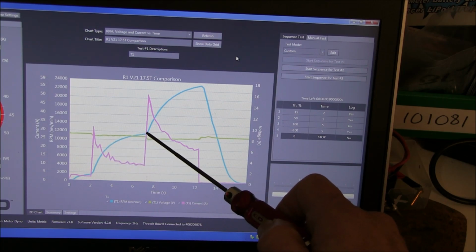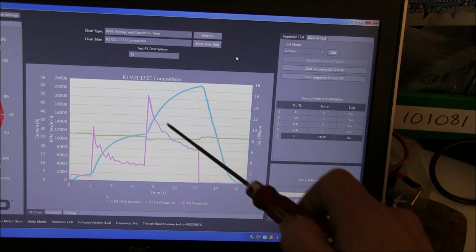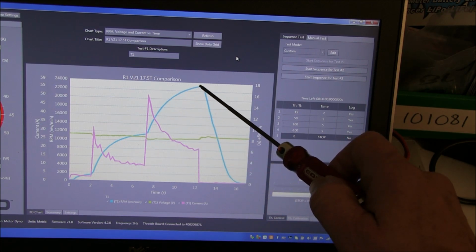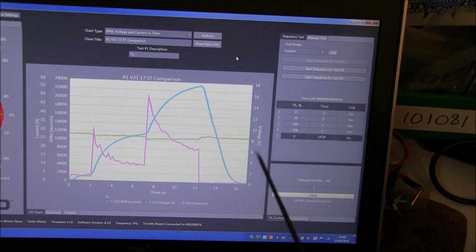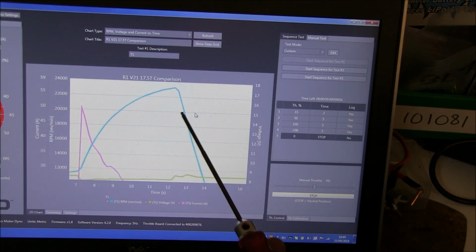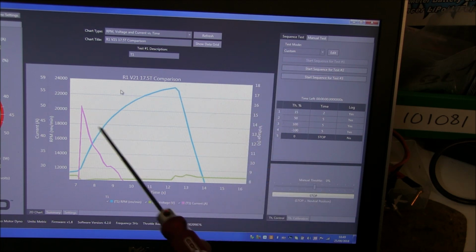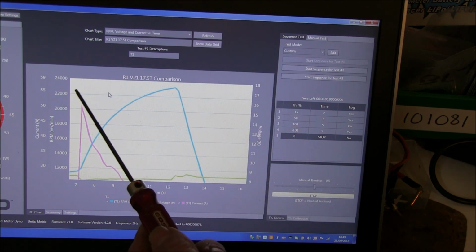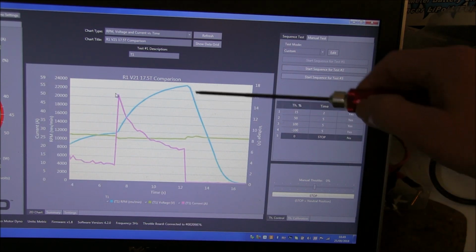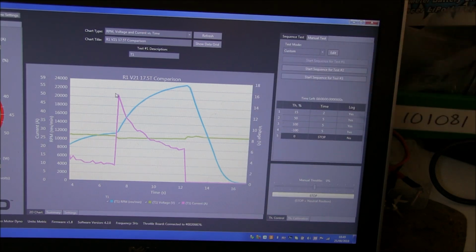Then we hit the 100% throttle, another spike in current, up to 50 amps this time, and the acceleration time, and it was still accelerating up to that point there. We have to stop at some point, so it would just keep on going till it peaked out. It's about 23,000 RPM. And then the brake time, well, the strength of the rotor, for instance, will give you the braking curve as well.